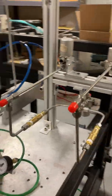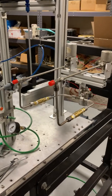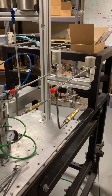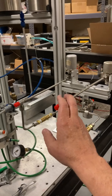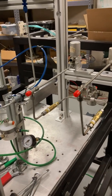We've also done the final kind of tighten up on the igniter side. I haven't said too much about the igniter side, but basically we're going to be using a torch igniter, a gaseous oxygen, gaseous hydrogen torch igniter. So that's going to come in from the fuel, gaseous fuel, which is hydrogen, and then gaseous oxygen over here. And then it'll have a spark igniter.